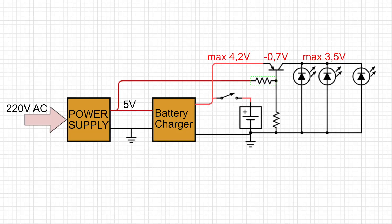Let's try to make this circuit. I'm going to use a PNP transistor to turn the LEDs on when the light goes out. I won't put any resistors in series because the voltage should drop to 3.5 volts and it shouldn't damage the LEDs, even though they won't be very bright. Be careful — this circuit is not suitable to fix all lights but will need to be adapted on a case by case basis.